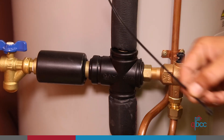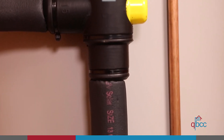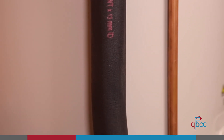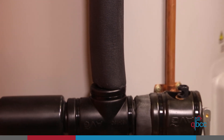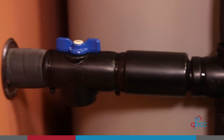The inlet and outlet pipes, including valves and fittings for a water heater, must be insulated with minimum R values for at least the first 500mm. You also need to insulate all relief valves fitted directly to a water heater — and not their drain lines. This insulation should not impede the operation of the valves.